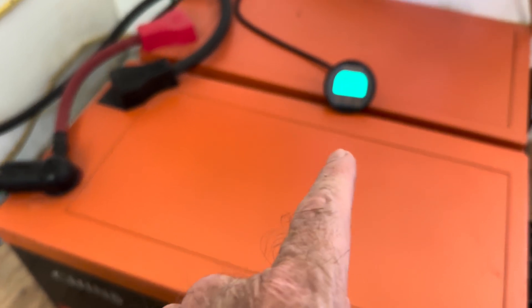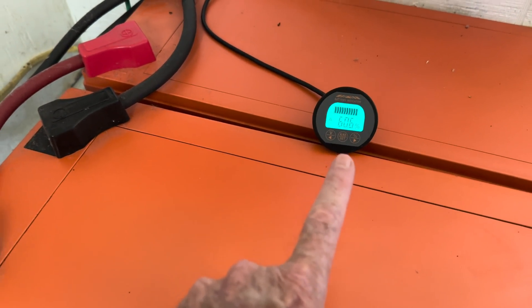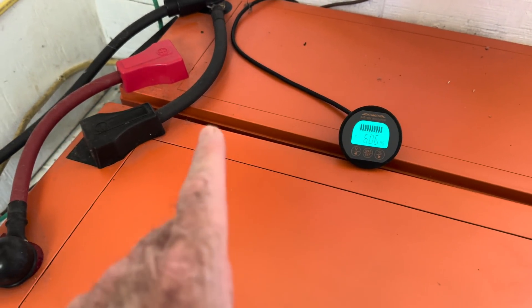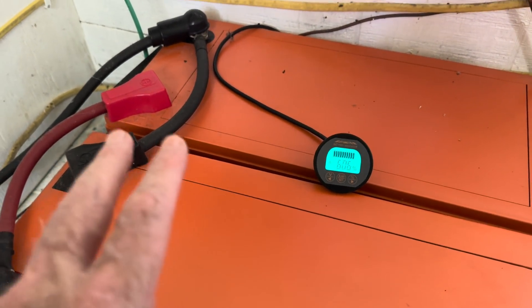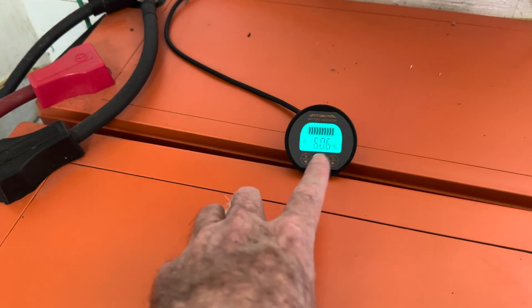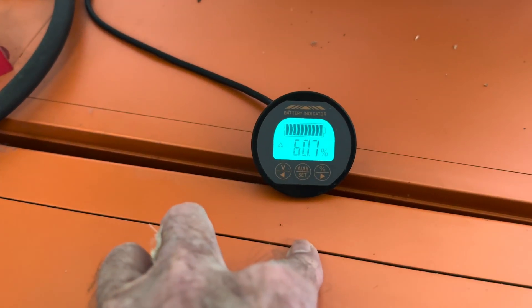It's in great shape. These shunts were kind of a necessity for me when I first started, and I still love having a real clear indicator of where my battery bank is. Because with the flat discharge curve on lithium iron phosphate, the whole time it's discharging it can be reading 13-point-something volts, and I never truly knew what that meant along the line. But then you put in what we're used to seeing — like a real gas gauge — and this was very helpful. I've added the shunt to most of my systems so I always know where they are as a state of charge.